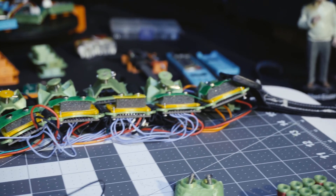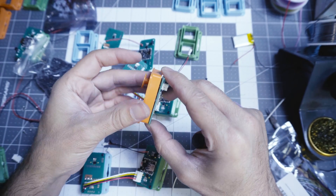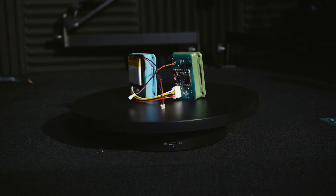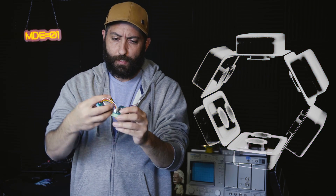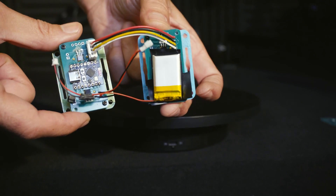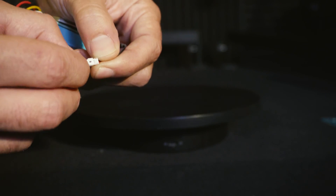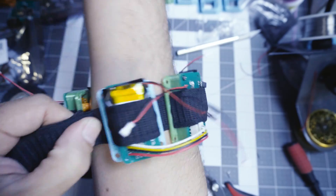The last OpenMuscle band was called OM12. It was a prototype, but all the wires got in the way. In the OpenMuscle PMG dev kit, we're using keyboard switches instead of custom mechanical pistons with a lot of components. These keyboard switches are relatively inexpensive, paired with two custom PCBs for the band. There are six cells in the PMG sensor band and each cell is comprised of two PMG sensors. One ESP32 links two cells together, reducing some of the overhead when it comes to wire harnessing.